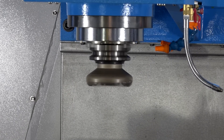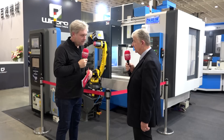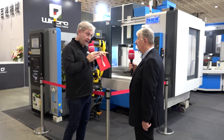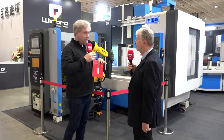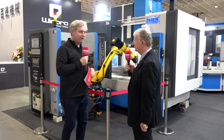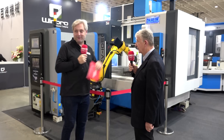It's enhanced by having the BBT 50 spindle taper as standard — not an option, it's standard — though it will also run with standard BT. With that you can do big depths of cut when required, as well as finer machining when needed.